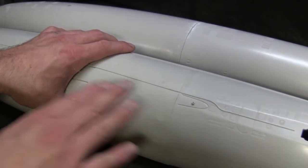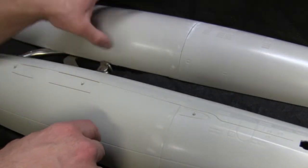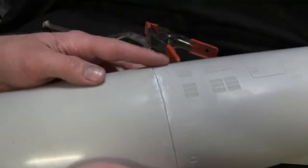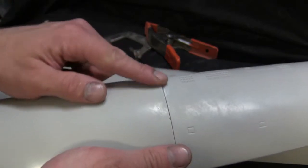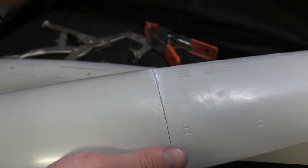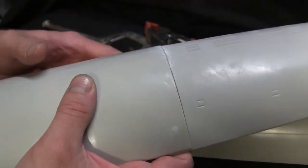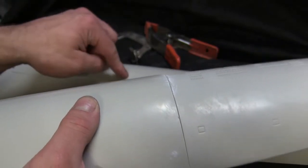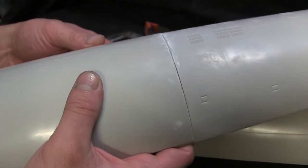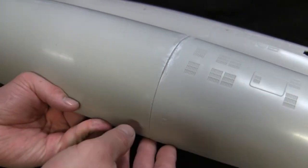Once the red putty sets, I could then go ahead and continue with the polishing with just some basic hand sanding. For this one over here, I'm going to hit it with a palm sander just so I could knock out as much of this inset as possible, and then once that is prepped, I could then progress with the smear of red putty and then pick up where the other one left off, which is some hand sanding with some sandpaper. Not gonna lie, it might be tricky to get on camera, but you know, we'll see how things pan out.